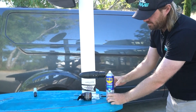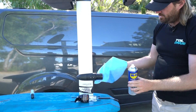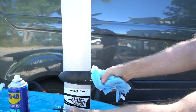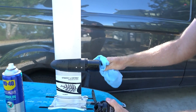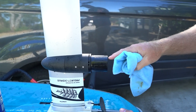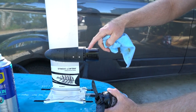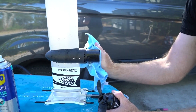We've got the WD-40 protecting sealant. Before you spray that on, grab any old rag or towel and dry each component off. I'm drying the stator here — the thing in the middle. This is the black, epoxy-coated solid part; it doesn't spin. You will over time start to see little scratches and nicks — that's okay. We want to get it nice and dry with the towel.